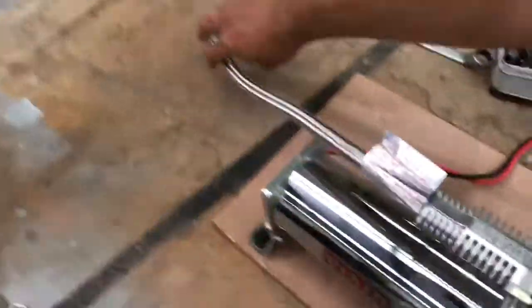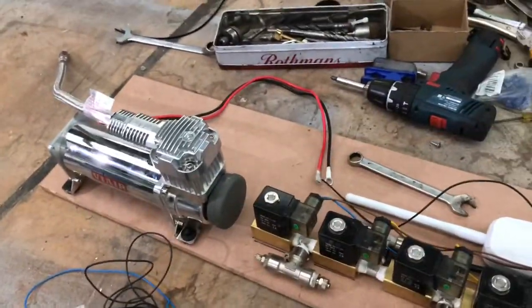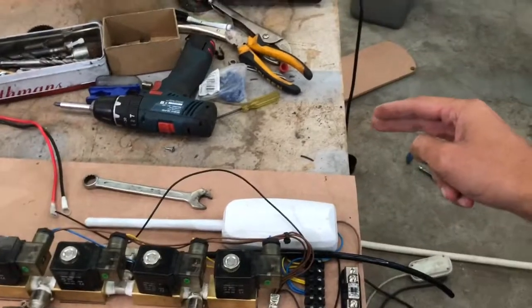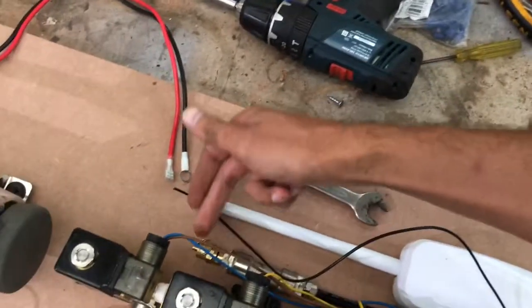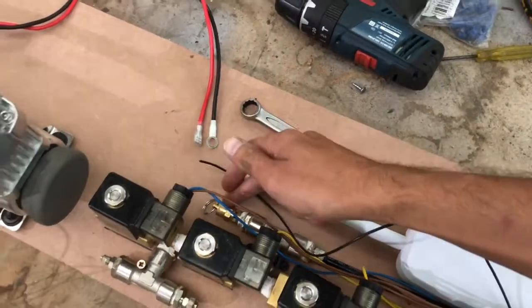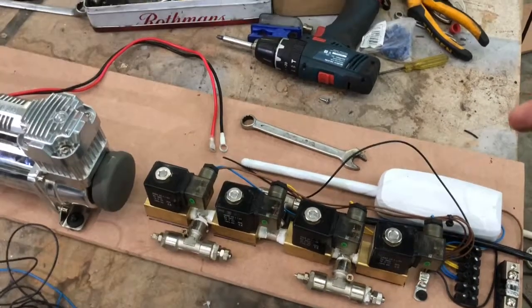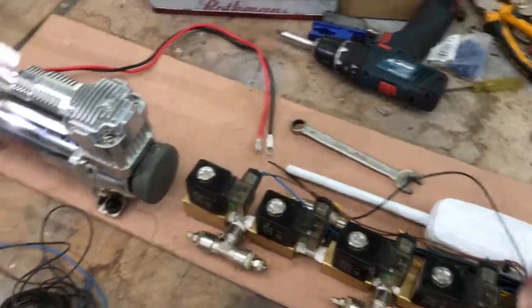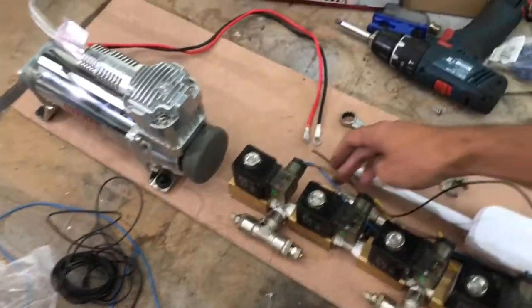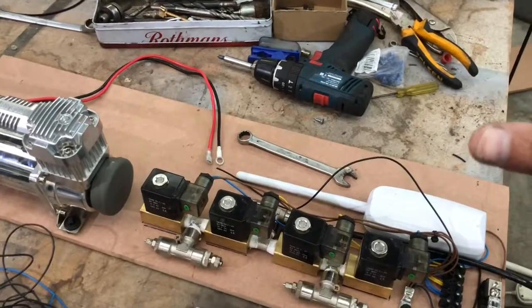You have the compressor going into the tank like that, then the outlet of the compressor coming over here, going down this pipe into the valve bank. There's a release valve over there — so if the pressure switch does mess up, the pressure is supposed to switch off at 145 psi. If it goes up to 175 psi, this will release pressure from the tank so the tank doesn't go over pressure and get damaged.